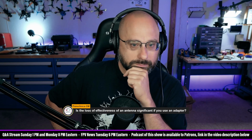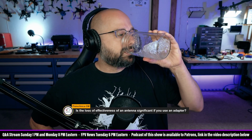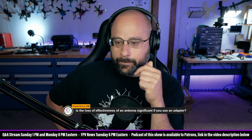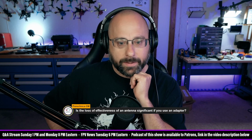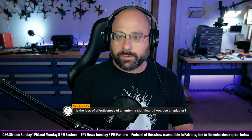100%. Yeah, and some testing we showed on the news a while back. Sandor de Bruner, DM4DS, did some testing, and he checked like 5 out of 10 from some different brands, and the 5.8 gigahertz, the longer ones, lost in some cases 3/4 of the range because of dB loss. That's how bad it was.